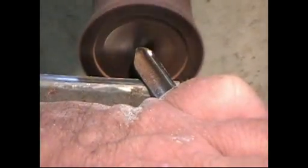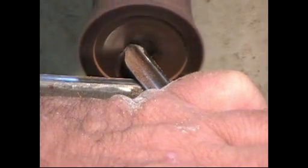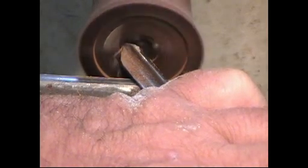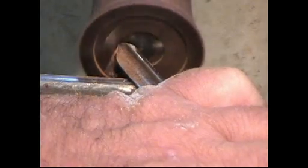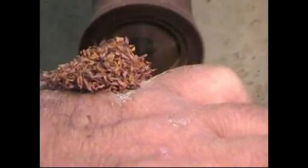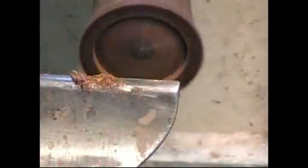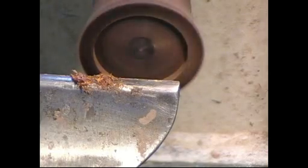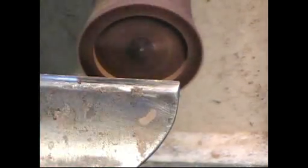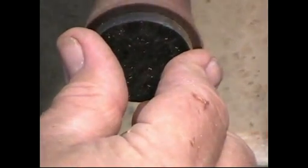And the bottom of my bowl, box, jar, whatever. Again, muscle memory says that's about where I want to be. I don't want to rub the bevel too much, but I need to rub it. I don't want to use a raw edge. I'm going to push out. There we go. That is the cut I'm looking for. That would be the finished bottom of my box, my bowl, my jar, whatever. But it could also be the recess that this fits in.